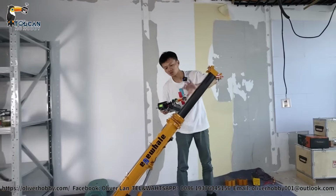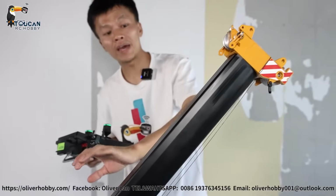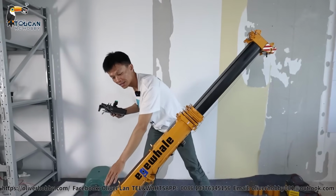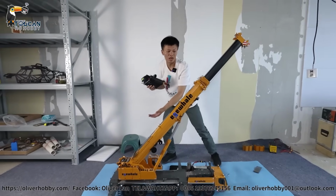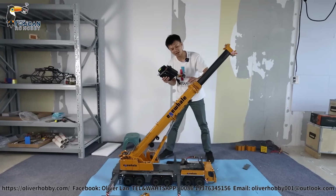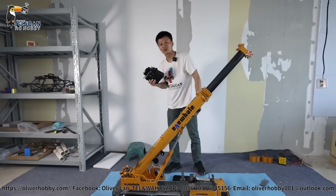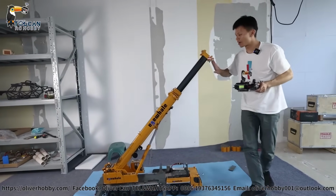Only one section exactly, all this one arm out. It will measure the distance by the sensor, then lock with the pin. Then continue. The cylinder will go back, and then secure the pin to the rear side of the second arm. Then we are pushing out the second arm in position, at the rear side of the second cylinder. The arm cylinder will lock the pin, and then the hydraulic cylinder piston will go back again for the next arm. So now let's run in all these wires.